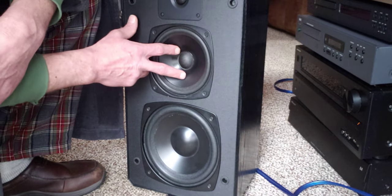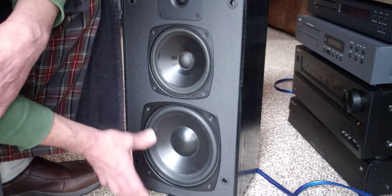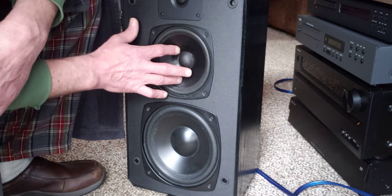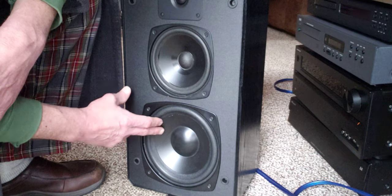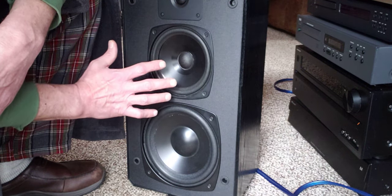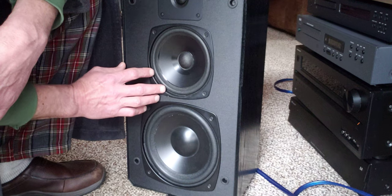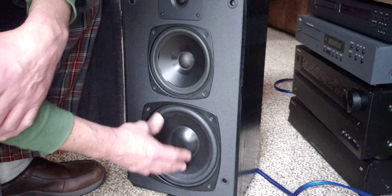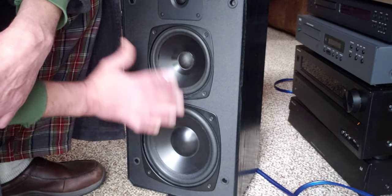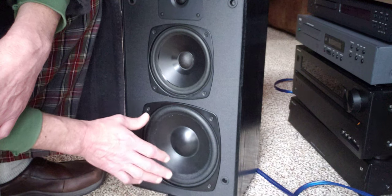Even though this particular driver is used as a midrange in some three-way driven systems by Boston Acoustics — which have an active woofer — in this system the little six-inch is going to be doing most of the work and doing the heavy lifting. A lot of times when you're putting the pressure to drive this kind of box on this woofer, it ends up taking the brunt of the abuse if you're playing loud, because this is what's going to be propelling the passive radiator. These two work in conjunction. Once you get this all re-foamed — it'll take an hour or two, maybe more — take your time and get it done.